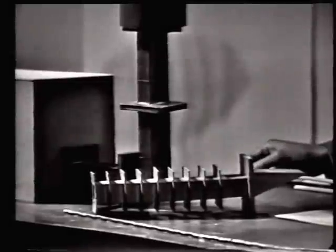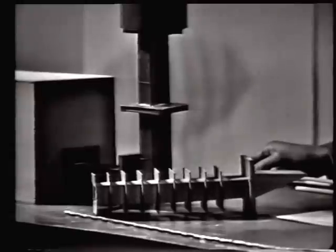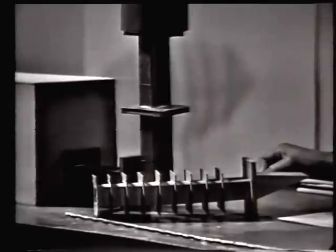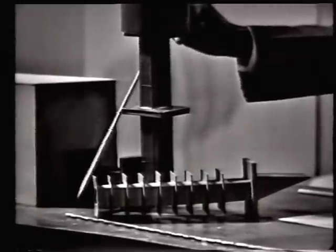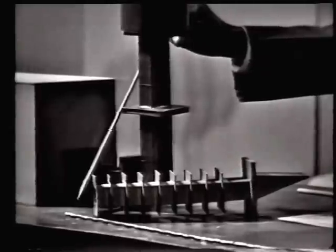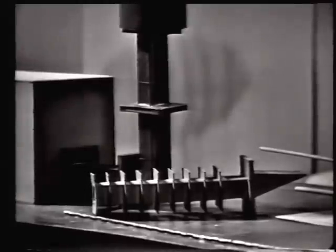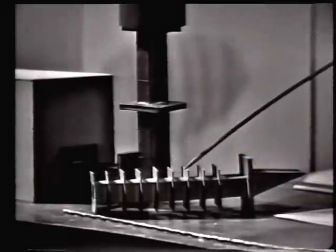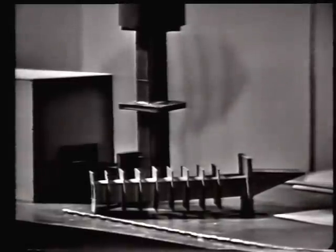In order for the dummy load to absorb and dissipate all of the energy we feed into it, it must be highly resistive. And they are commonly constructed by making the walls of the waveguide from a power-absorbing material such as powdered graphite and a cement binder. This section of the dummy load is inserted right into the waveguide to match the impedance of the waveguide to that of the dummy load. Now, because the dummy load is so highly resistive, all of the energy entering it will be dissipated in the form of heat. These wafer sections you see here are the cooling fins to give us more cooling surface area. Even with all these cooling fins, the dummy load can still become very warm when the set is operating.